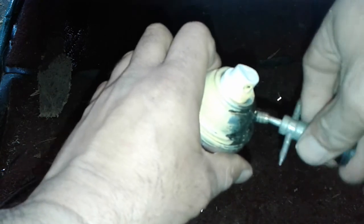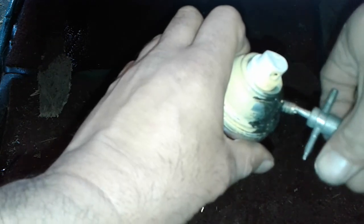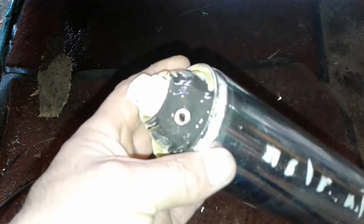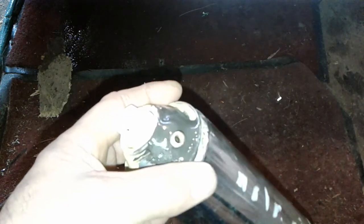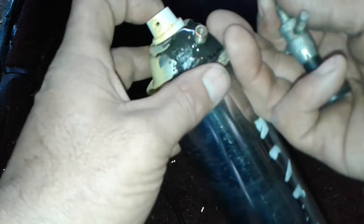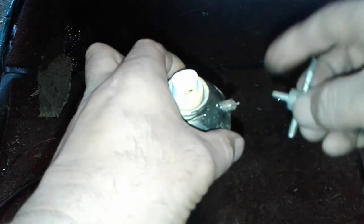To add something to it, take out this valve core and the valve stem. Now you'll pour whatever you want down in there. If you wanted to do this to a WD-40 can, you could pour something like transmission fluid in it, pressurize it, and the air would push the fluid out through the tube and out the spout. So you can refill an aerosol can.